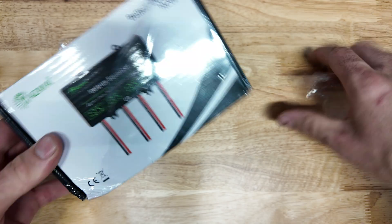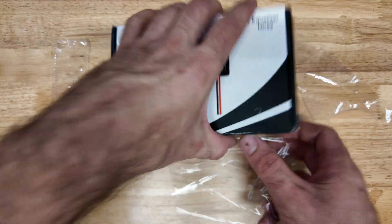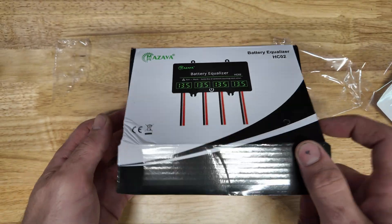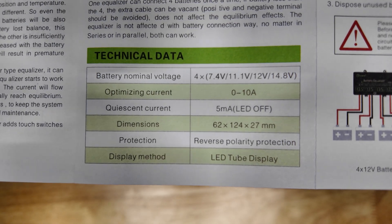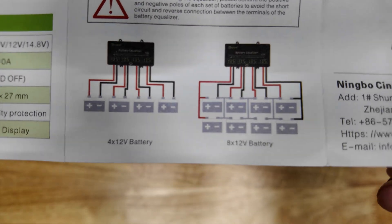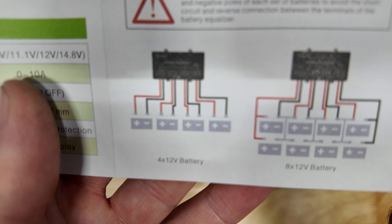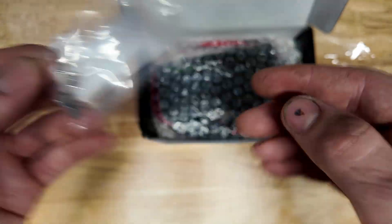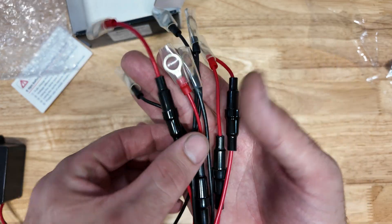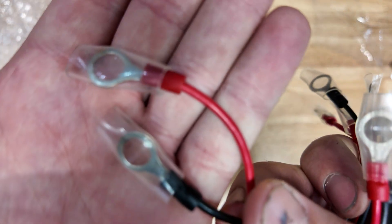I think I paid about $70 for this — I will leave a link in the description if you guys want to check it out. It is a little pricey. What I like about this one more than the one I'm already using is it has these little displays. I purposely picked one that has that, and it also has a power button. According to the specs, it can do up to 10 amps of optimizing current, so I'm assuming that means it can transfer 10 amps from one battery to the other. It also shows you how to hook it up. We take our four 12 volt batteries and each one will be connected to one set of leads. Each lead also has an individual fuse for safety — I like that a lot. And it just has normal ring terminals.